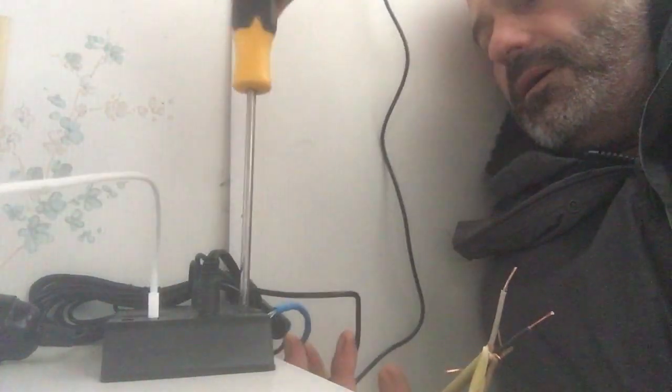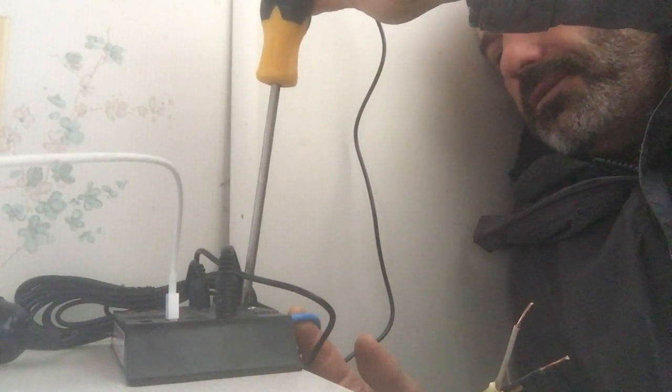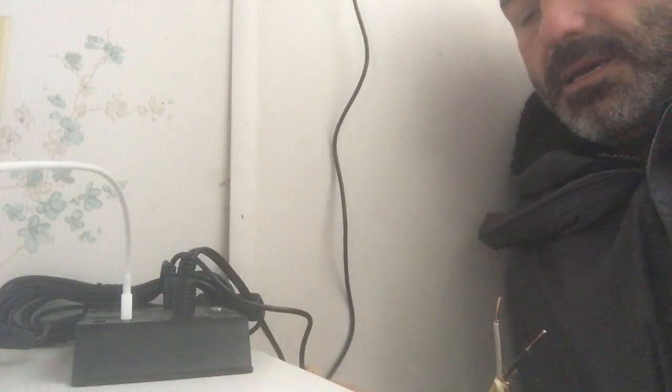What I actually did was take a wire nut that had a little metal part coming out of the inside — there's a little metal part in many wire nuts. I took that metal part from the inside of another wire nut and put it right on the end of these wires so that the screw-down connector would work. This is the first time I've seen a screw-down connector that didn't have a flat side on each side. I took two pairs on each side, put that wire nut piece around it — you can see where the screw pushed down on it. That gave me enough of a solid end to make a secure connection.